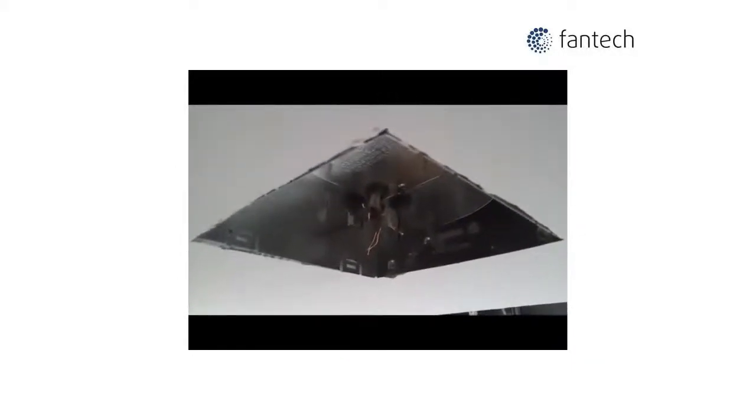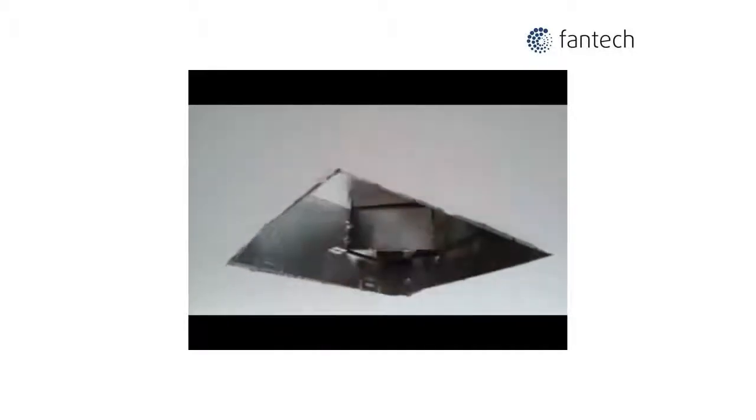From inside the bathroom or space where the fan is, restore the electrical connections. Make sure they're out of the way, tucked up in the corner. Insert the electrical cover. And replace the fan motor panel.